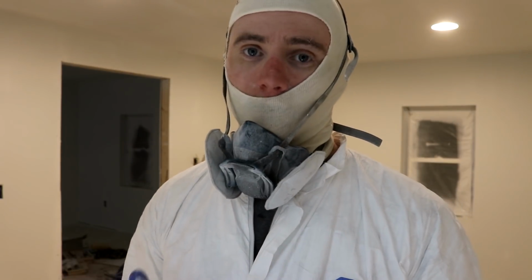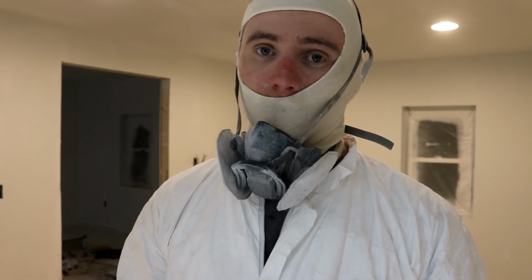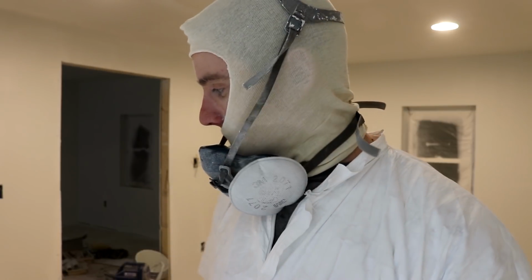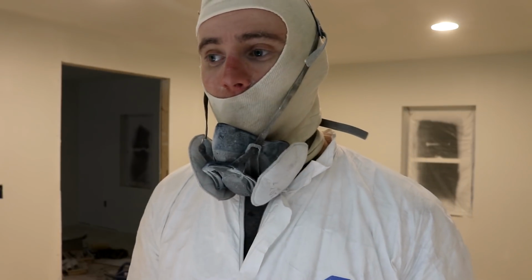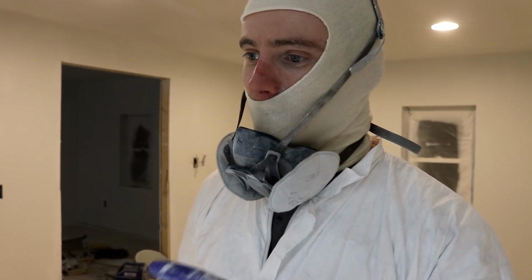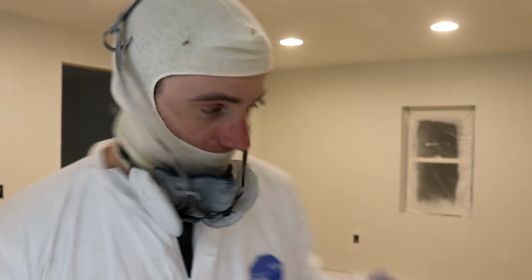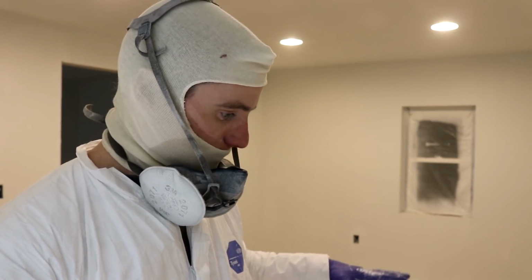I'm not going to run the flooring up under the cabinets. But the flooring will go under the vanity in the bathroom, under the toilet, things like that. Then I will probably come in and I'll start doing some trim work. Doors will be installed, I don't know, before or after the floors, probably after. Toilet, the vanity, plumbing fixtures will start to get installed into the countertops.